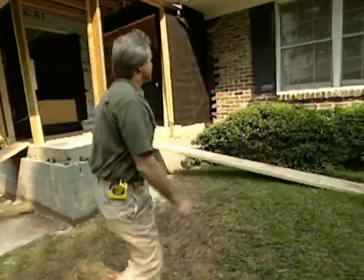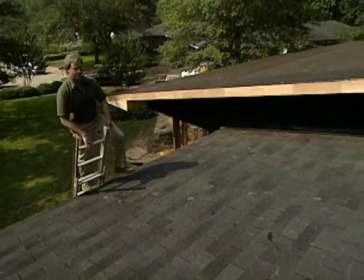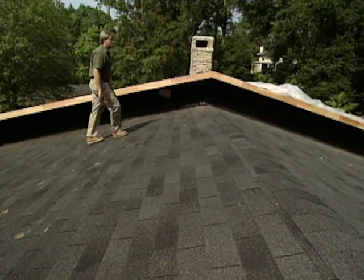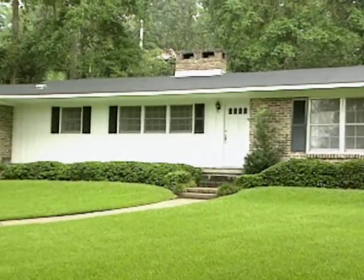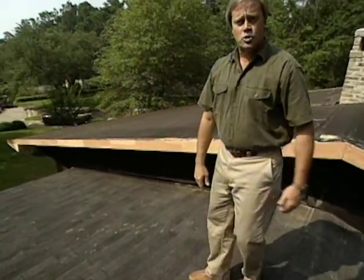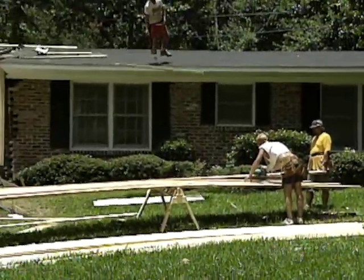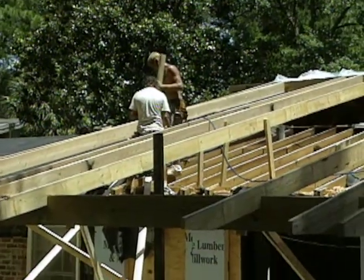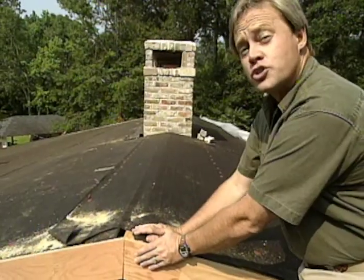We were real fortunate because the existing roof shingles were in great shape — very pliable, only about a year and a half old, so it made it very easy to work with them. The original roof had about a 3-and-12 pitch and it extended right across the whole length of the house, much like most ranch style homes. But to accommodate the 12-foot addition on the front and an equal addition on the rear, look how we were able to create a roof that more or less saddles on top of the existing roof. We started by putting a ridge that ran the length of this portion of the house, then installed our rafters off the front and the back, put our plywood on, felted it in, and completed the fascia and soffit. Now the roofers are setting up to put the shingles on.